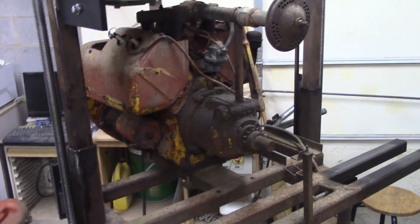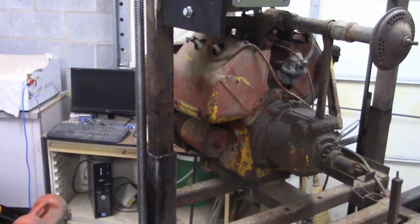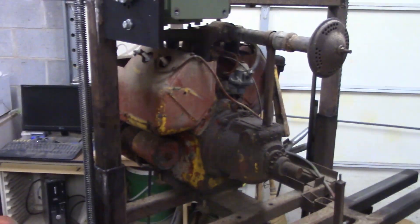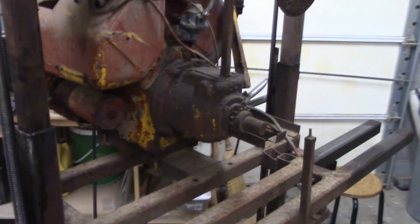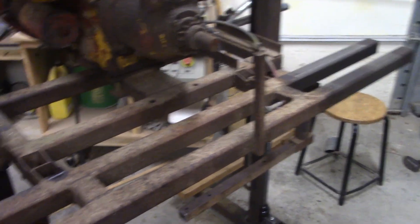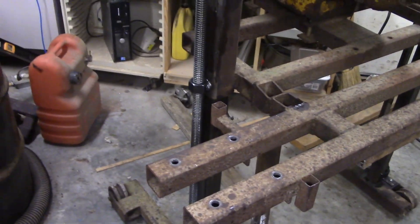This is my homemade sawmill and I've been using this thing for years and years. A lot of it had just kind of worn out and it was time for an update. I'm going to talk today about the lift mechanism. You can see the motor on this thing — I think it's a Wisconsin VH4, a gigantic motor. It weighs like 600 pounds and the rest of the metal here weighs a couple hundred pounds more, so I figured I'm lifting close to a thousand pounds. I needed some heavy-duty gear.